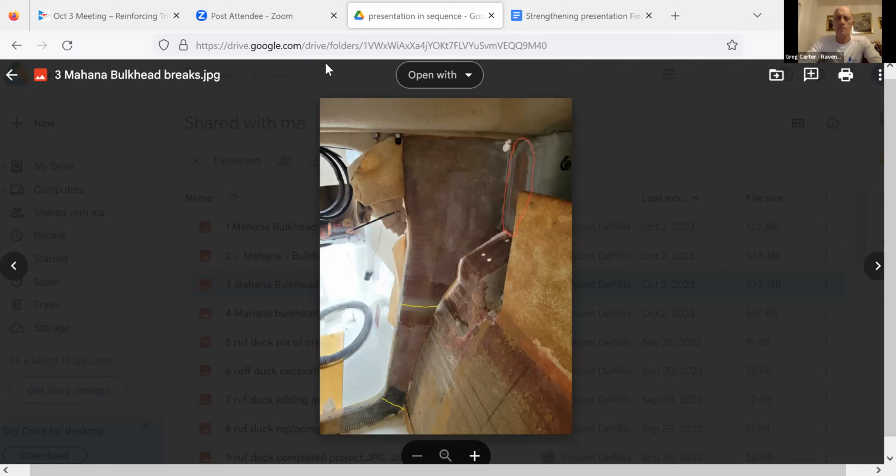That's a huge part of the problem because it propagates right down the whole side. When you say dry, meaning no epoxy? No bond at all. So on all of these boats, if you get a Friday hull layup and a Monday bulkhead, that's secondary bonding, at best vinylester, and on the earlier boats plain polyester resins. Secondary bonding is not good. It's about 40% as strong as it would be with epoxy. Wow, 40%.